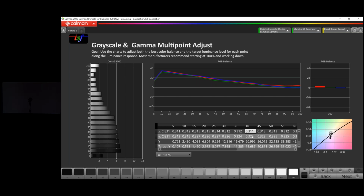Now, if we look at the Y number, that's 323. It's going to be slightly south of the box, but it's not north, which is good. And I'm not seeing any dots here north of the box. And I'm also not seeing any numbers in Y that are above 329. So this is good. Let's do this again this way. As we go all the way across, oh, I do have a 330 at 95 and a 330 at 90. So if we look at X, we're basically 311, 323, 312, 311, 315, 316, and there are basically no visible errors in X. And there are really no visible errors in Y except for 90 and 95.